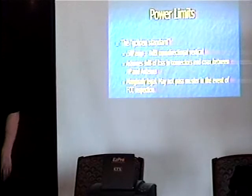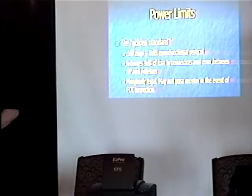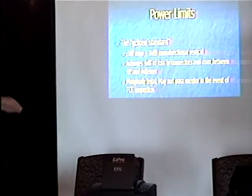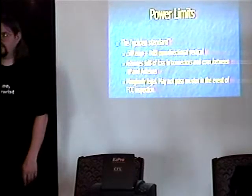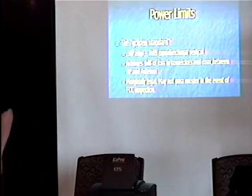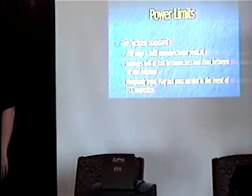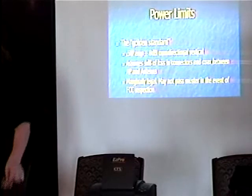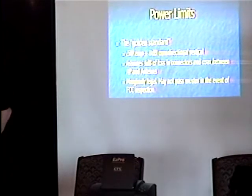The FCC maximum effective radiated power is 36 dBm for point-to-multipoint transmitters. When using point-to-point, the maximum is 44 dBm EIRP, which is somewhere around 50 watts or so. But the transmitter power must be lowered by 1 dB per 3 dB gain over 6 dBi — which realistically isn't a problem until you start dealing with dishes about six feet or bigger. The dishes used at the Wi-Fi shootout at 125 miles were not derating for power. I remember doing the math: if you're using a 32 mW Orinoco card, you actually have to put attenuation between it and the antenna in order to maintain compliance when using a 12-foot dish.